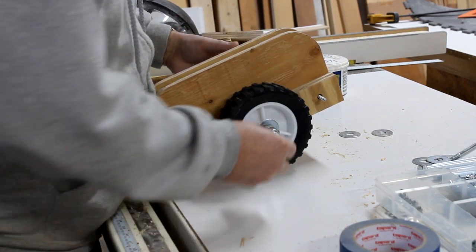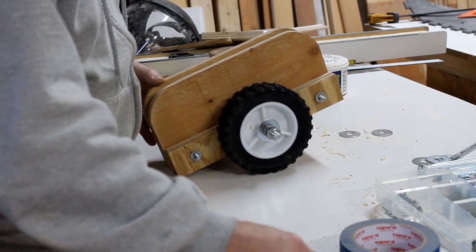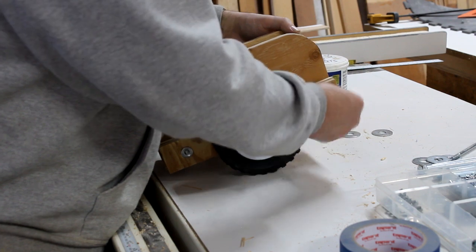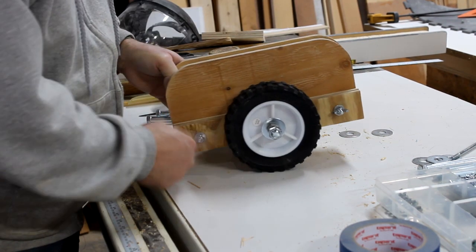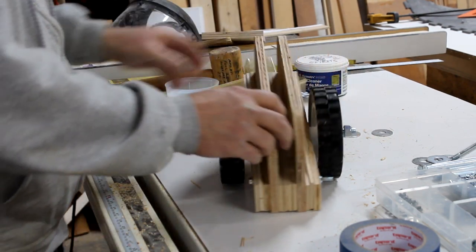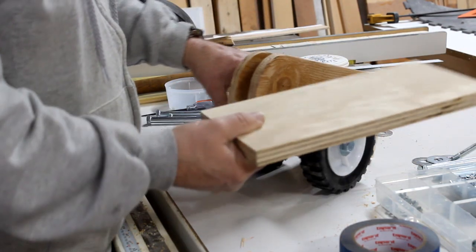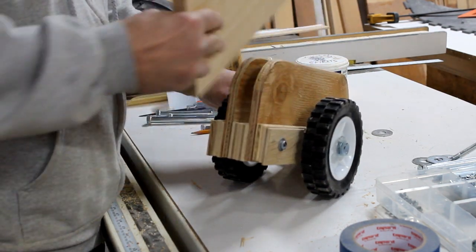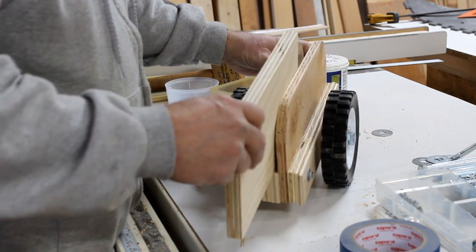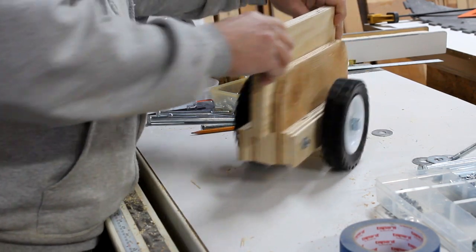And now, I'll just take these 4.5 inch, 1/4-20 bolts on the ends. I'll just take some wing nuts. Snug it up. And now I have a two-wheel dolly, and when I go to put in a piece of, say this is a 3/4 inch ply, if I had a full sheet I wanted to move around, this will fit in there. And I didn't want to snug it too tight. This way here, it goes in and out very easily. There's not much slop, so you can still control the dolly when you're rolling around.